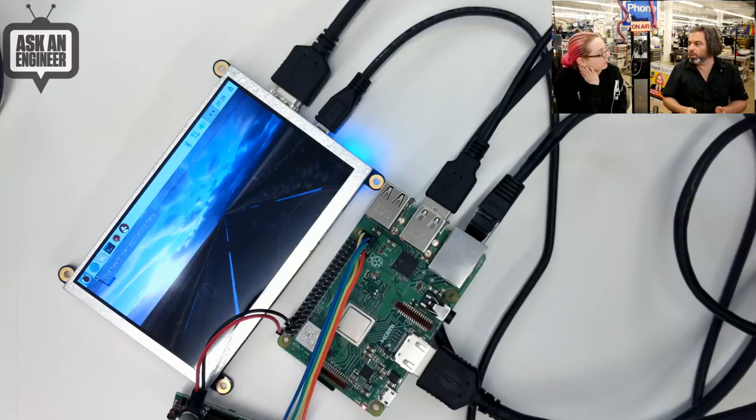I'll tell you where this will be the most handy. So we're in New York, and there's tons and tons of interactive displays. There's tons of exhibits. And sometimes I use a Raspberry Pi, and there's just tons and tons of cables. Yeah, this would be one of those times. It's like, oh, when would you use power over Ethernet? Well, when you want to minimize the amount of cabling you need to do, especially if you had 50 of these. I don't really have 50 power supplies.